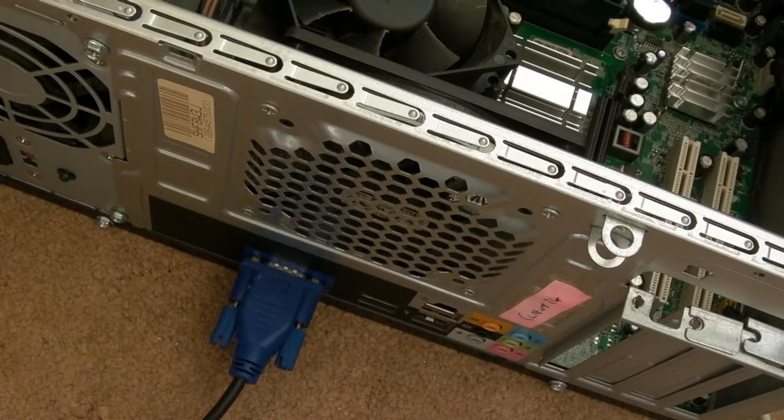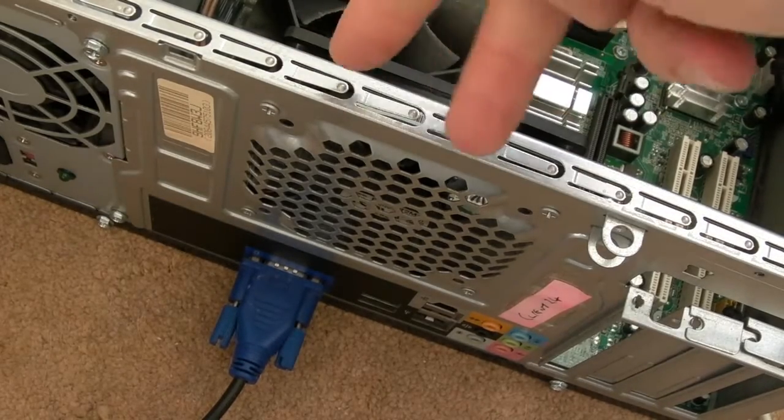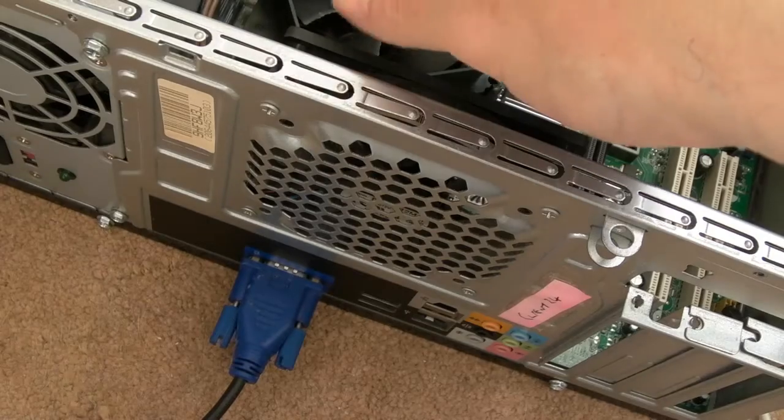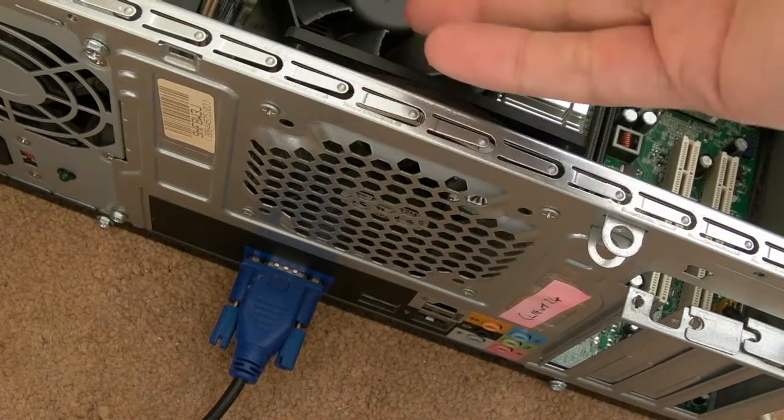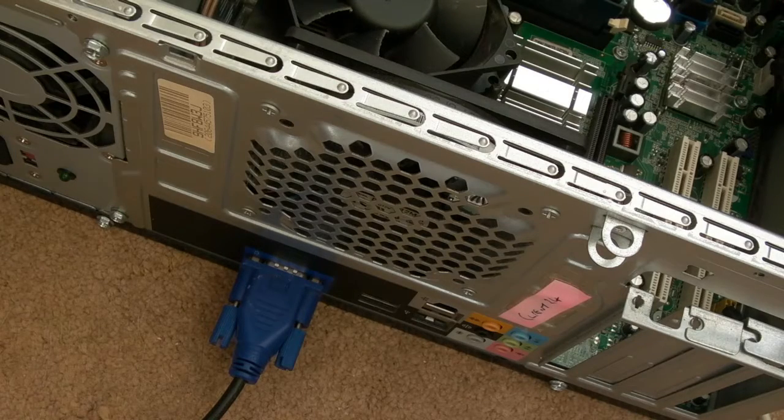So, the moment of truth. I've been as careful as I can here, reassembling it, and made sure everything's connected up. The one thing that's not in there is the network card at the moment. Just after getting the CPU back in, I did measure those connections on that MOSFET to make sure they weren't shorted still, because you never know. I think you may be able to measure something there if the CPU had shorted. So yeah, let's just go for this now.